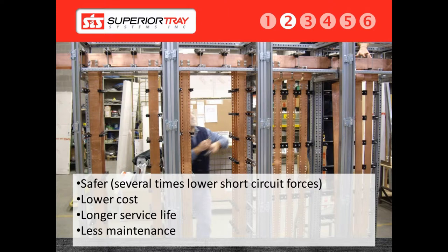A cable bus requires no specialized equipment to run, unlike a bus duct system, which requires heaters to prevent temperature fluctuations and moisture, and special seals to prevent water intrusion into the duct. A cable bus requires no specialized equipment. The same setup is used both indoors and outdoors. Wall seals are used in order to allow the cable bus to pass through the wall while maintaining a weatherproof barrier. A fire-rated wall seal restores the integrity of a fire-rated wall where the cable bus passes through.